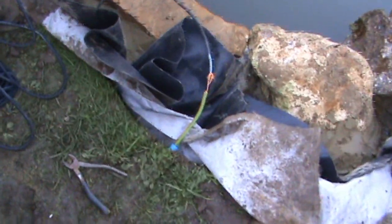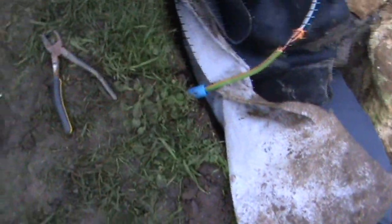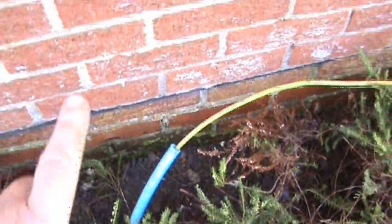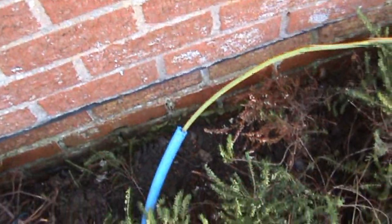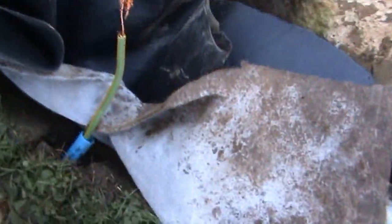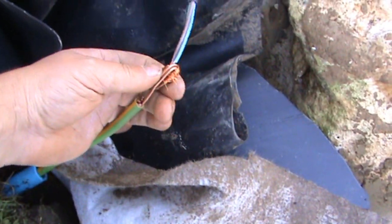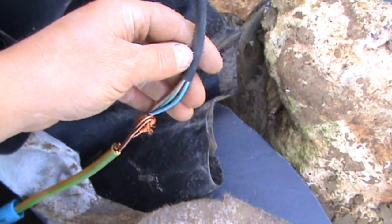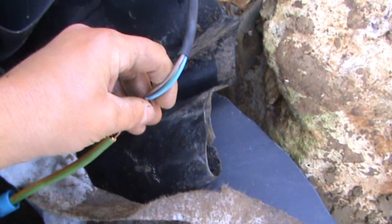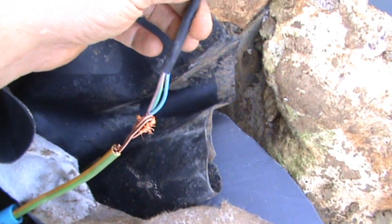This is a handy trick. We've got the conduit that's going to supply the pump, buried through the lawn under the paving slab, and it comes out here. There's going to be an electric box on the wall there to distribute the power. But obviously the cable, because it comes like that, doesn't stand a cat in hell's chance of going through there. So we've got a thick earth cable - pretty much inflexible stuff, very thick. We've stripped the pump cable down and tied that onto it, so when we pull from the other end this should pull the pump cable through with no problems.